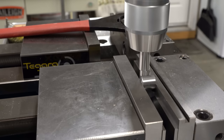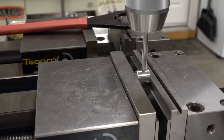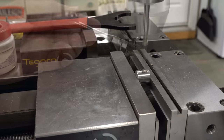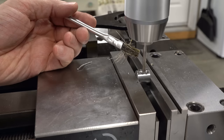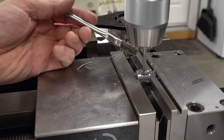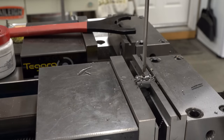I'll use the half function in the DRO to locate the two sides of the part and then drive to the center. Start the hole with a spotting drill, checking with a scale to make sure it looks sane. Then I'll come back one size under 3/16ths and drill the hole through into the interior of the part. I'm going to ream this hole to 3/16ths of an inch exactly - actually I'd like it to be slightly on the large side so that it ends up being a clearance hole for the 3/16ths inch handle. To that end I'm using ordinary cutting oil to lubricate the reamer, because with cutting oil the reamer will cut on size or slightly larger, giving me a good slip fit on the handle.